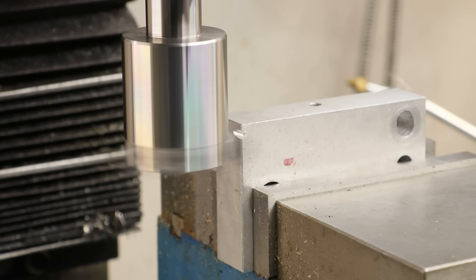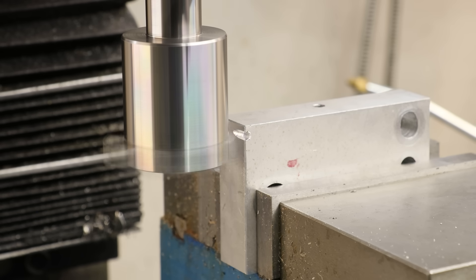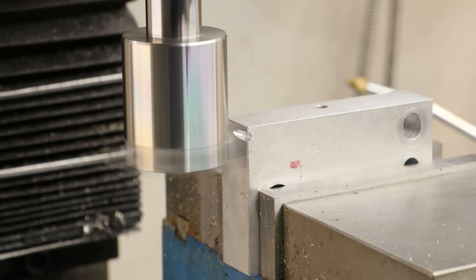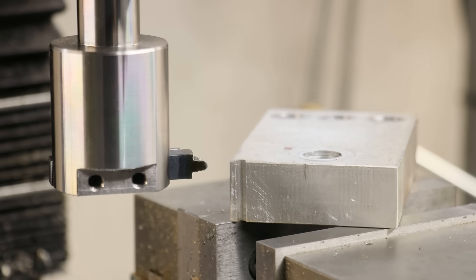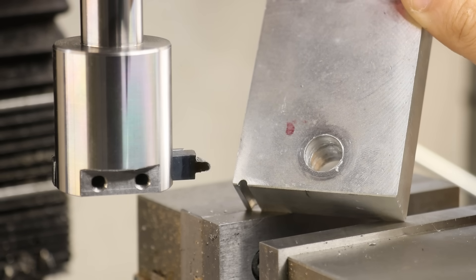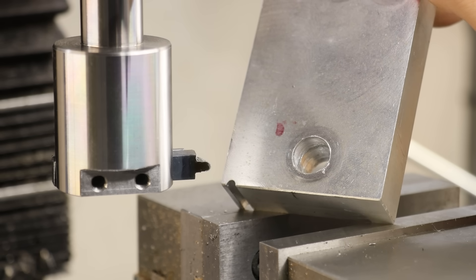And that is cutting pretty nicely. The great thing about this type of tool is that it only needs a few hundred RPM to achieve adequate cutting speed, as opposed to the several thousand I was going to need with an end mill. With that said, you do need to take it easy with this cutter — the cutting geometry is still pretty basic and it is a single cutting edge, so it needs to take its time. In the end, I'm still pretty happy with the final result. Definitely very usable — that is the profile I wanted, it's just a little bit slow. More importantly, this is a fairly simple profile, but this sort of setup would be perfectly suited for a more complex profile too, and I'm definitely going to be trying it out in the future.